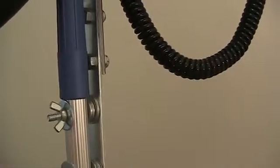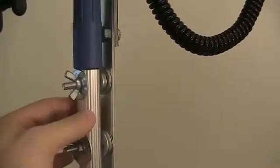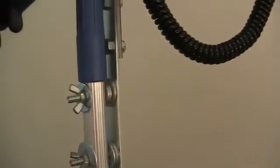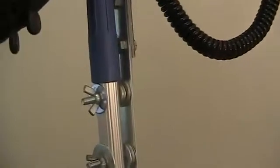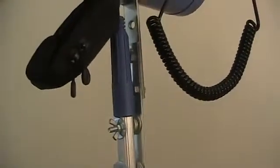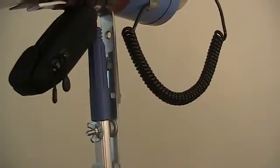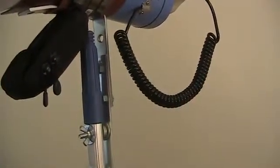And so yeah, I don't like the idea of that, like I said, because this telescoping pole can be compacted under pressure, and so I didn't want to put a lot of torque on this. Instead, I was very careful on where I drilled the holes in the telescoping pole. Ideally you would want each bolt to be touching the top of the bracket's hole. That way the weight of the system goes to the bolt. Otherwise you might have to torque the wing nuts more, possibly compressing your pipe slightly.